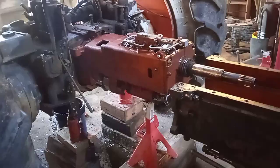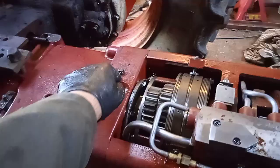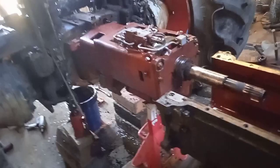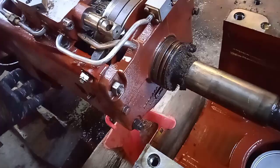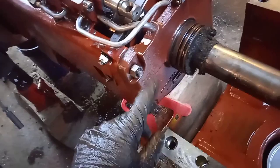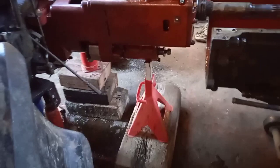A couple of other minor bits had to come off too. There's also this oil pipe I forgot — I do need to take that for the next bit anyway. So I'll now get the engine hoist around and undo the four bolts or nuts, and then it all slides forward off these long studs. These small ones hold this end plate on, but the whole lot should just slide off. It's quite a compact little unit really — I'll get some strops around it on the engine hoist.